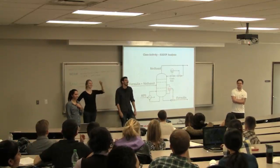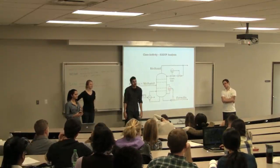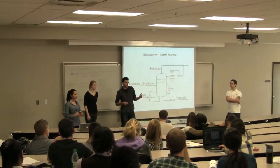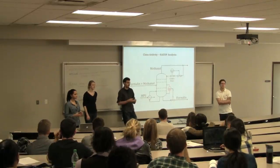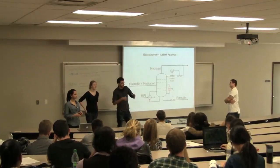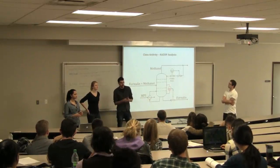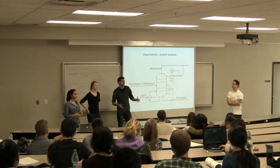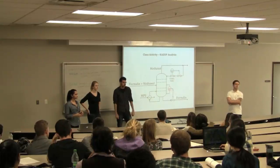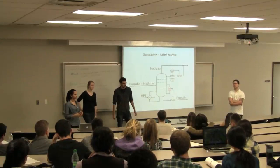Can we confuse you? Is there a way to extend the life of your catalyst? Yes, you design your reactor bigger. The catalyst degrades at a certain rate, and depending on the size and amount of catalyst you have, you get a certain lifespan before you have to regenerate it. We designed our reactor for a lifespan of 3 years, because that's the average catalyst lifespan that's optimal. If you made it bigger, which gets more expensive, you can make it 6 years. I know some catalysts run for 15 years. It just depends on how you design your reactor. But you can only regenerate it so many times before it's too poisoned for regenerating.